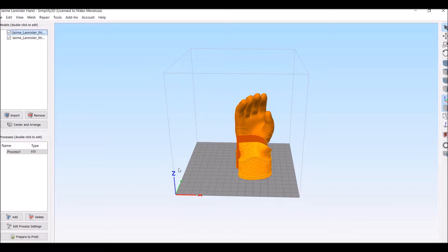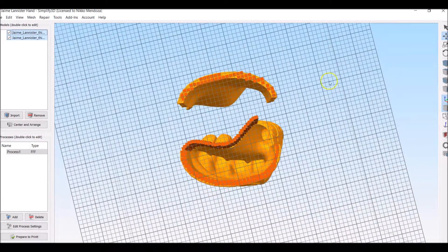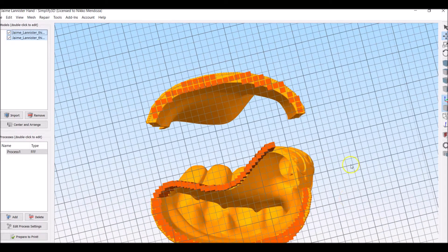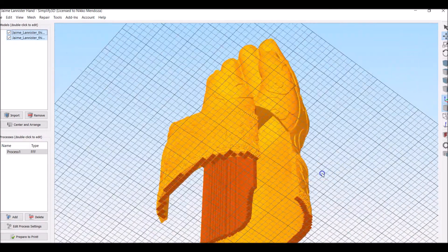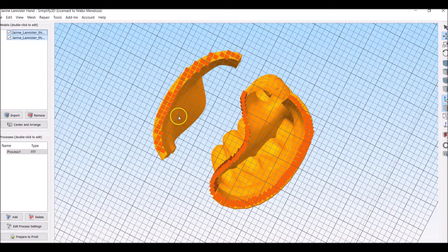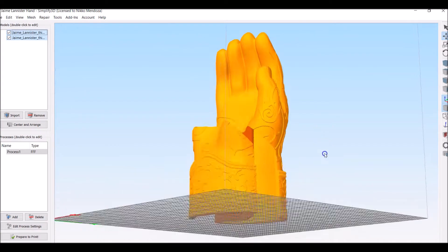So this is how we're going to do the supports on this. We are going to do these two right in the center. The bottom is not flat to the bed, so we're going to want something underneath it. This is sufficient — we just want something that's going to touch the bed and let us create this space where you can print. Same with the other one. The rest of it does not really need supports. I just put supports underneath where this part is.